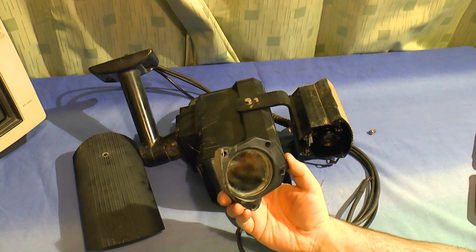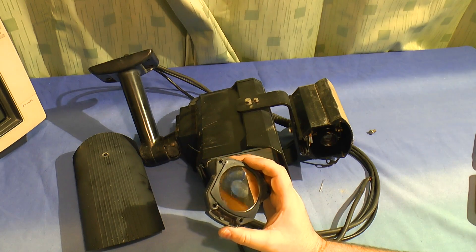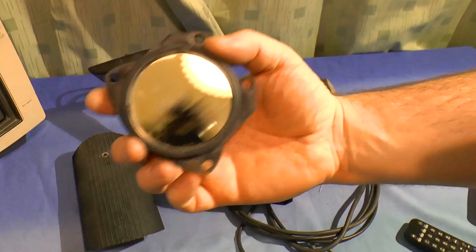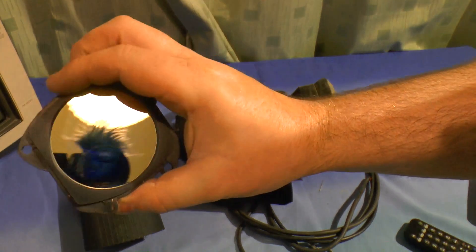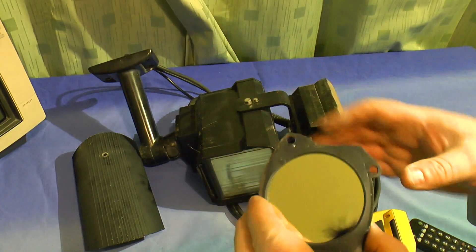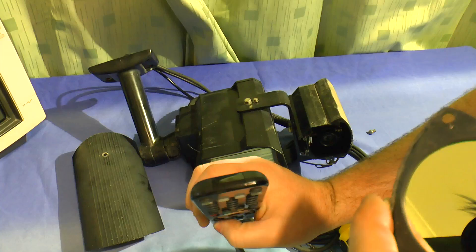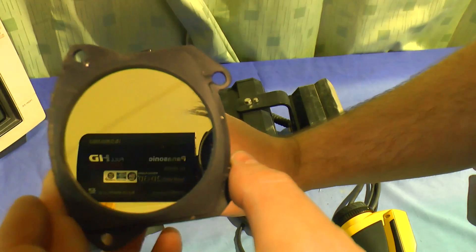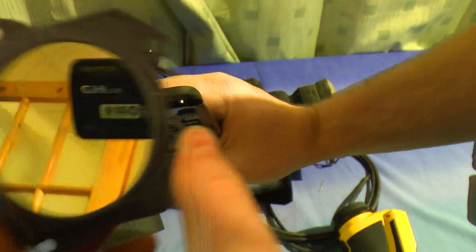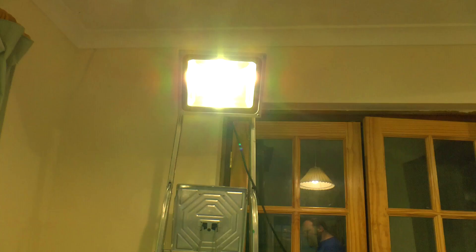There's quite an interesting piece of what looks like glass - whether it's coated glass I'm not sure. There's a bit of condensation there, let me wipe that off. What it appears to be is some sort of glass lens with a gold layer on it which reflects most light back. But if I get a remote control which my camera can pick up, that infrared light still shows up and in fact is the only thing that shows up through the camera. If I look at that LED floodlight, that's all it can see - that's all the light that's coming through.